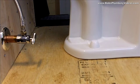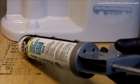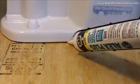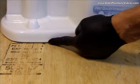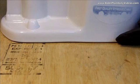After we've tested it, leak tested it, we're happy the bowl's sitting nice and solid with no leaks, we're going to come in with a good quality latex caulk and squeeze a bead underneath the bowl between the bowl and the tile floor. Once you squeeze your bead in there, I'll take my finger and actually squeeze it in there real good. My final stage is to get my sponge, wet it with some clean water, and just wipe it down to make a nice clean line all around the bowl.